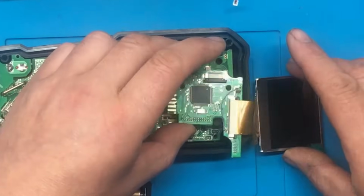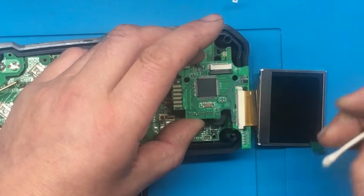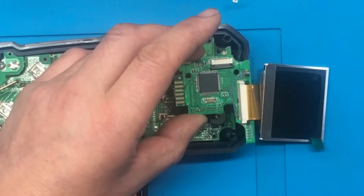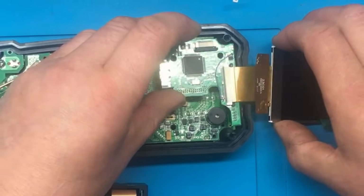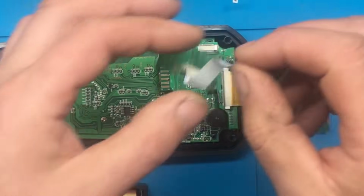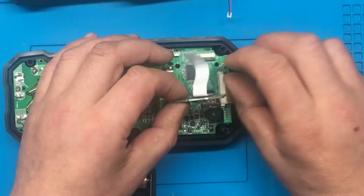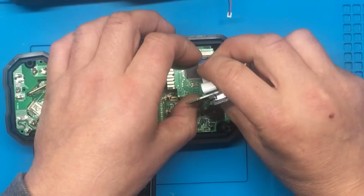the PWM signal for the backlight, I've actually soldered a wire from that. All that does is give out a square wave constantly, and I've wired it to where pin number two goes to the CPU. So let's see what it makes of that, if anything, because at least it's going to be getting a signal that's changing. This is me logic anyway, and we'll see what happens. I'll just plug this sensor back in. There we go.